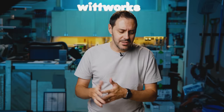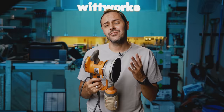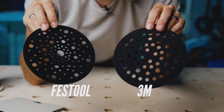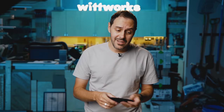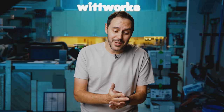Now for those complaining about Festool or 3M — backing pads wear out on those sanders too, and it's not exclusive to higher-end brands. Every sander is going to take this hit if you're using Extract. 3M makes their versions called Hook It, and they have a more universal pattern in five-inch and six-inch. They do stick to Festool sanders, but the hole patterns are different. If you have a Festool sander, I recommend the Festool protection pad because the holes will line up and you'll get maximum dust extraction. If you're in a pinch, you could probably get away with the 3M version, but the hole patterns don't line up with Festool's. So if you have the 3M sander, get the 3M Hook It ones; if you have Festool, get the Festool ones. Six or seven dollars goes a long way in helping you use your sandpaper and protect your backing pad.